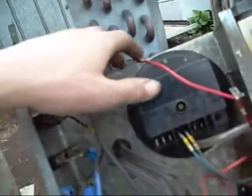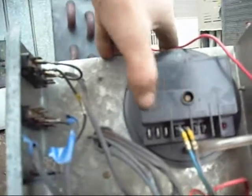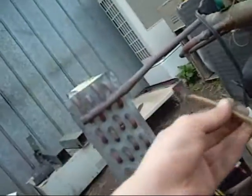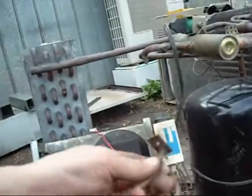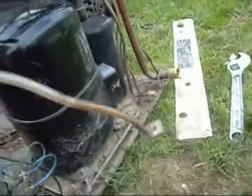This little control here indicates the temperature sensor input, as well as a vacuum tube. This vacuum tube attaches to the cabinet with the condenser fan on it, so when the condensing fan runs the cabinet will be under a bit of vacuum as the fan is drawing air through it, and that will tell this module that the fan is running. If the fan is not running and doesn't run for any amount of time, it knows something is wrong and it will not run. So that has to be hooked up — if that fails or breaks, it could be a cause of no start-up.